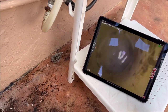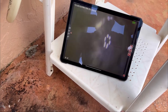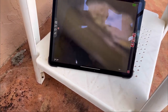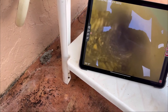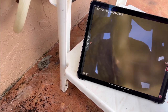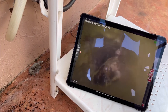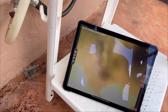We're going to have to bring the hydro jetter and jet this line out because it's really bad. We're in the clean out going in, and you can see the base of the stack is holding water. Look at that grease in the line — I'm going to try to push it all out. Look at the top of that pipe — it's just full of grease. We'll push this grease out as much as we can to alleviate them, but she is going to need the hydro jetter. I can't even pass the camera right there, it keeps getting stuck.